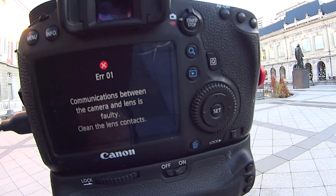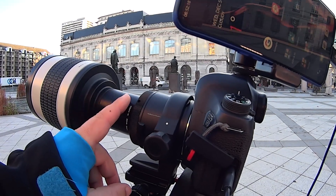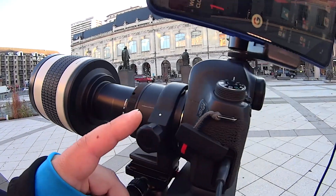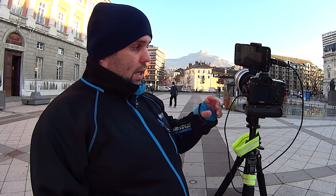Houston, we have a problem. The app is frozen and the camera is showing a communication error between the lens and the camera. I know the Sigma lens sends information from the lens to the camera, but since this mirror lens doesn't send any electronic data, the camera flips out. So the only solution is to cut the communication between the Sigma doubler and the camera. What I'm going to do is quite stupid — you should never ever do this — but I'm going to slightly rotate the camera to physically uncouple it from the Sigma 2x teleconverter.